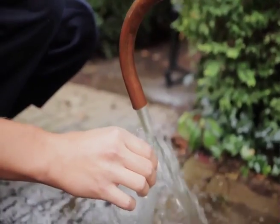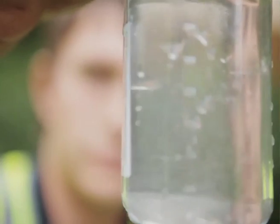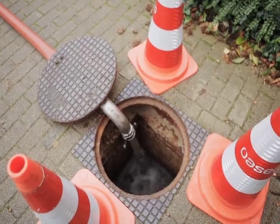That's something you have to take into account for a drinking water company. With ice-pigging, you don't damage the inside of the line and there are no chemicals. It means minimum disturbance for the customers and minimum cost for us. It's very low risk — if the ice were ever to get stuck, it will simply melt. The pipe may not need to be cleaned for another five to ten years.